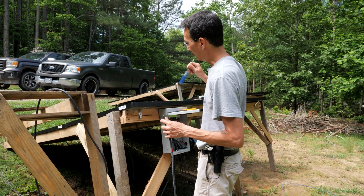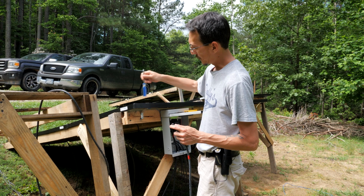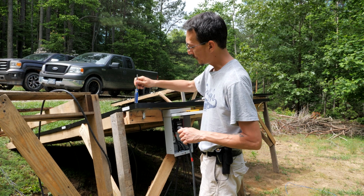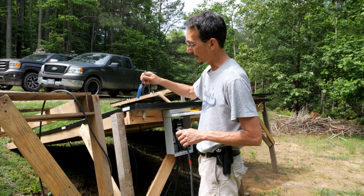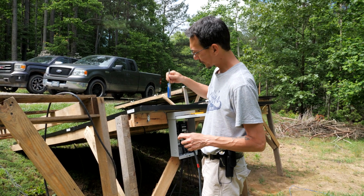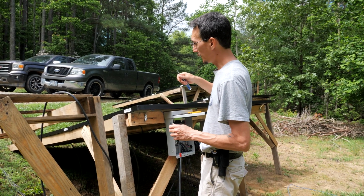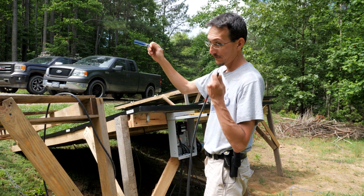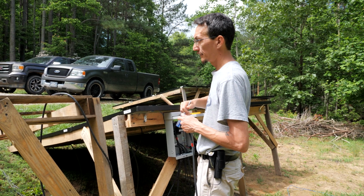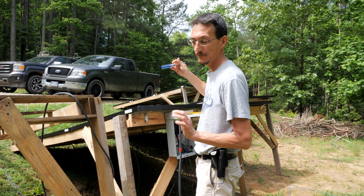So I'm planning to have these 3, each string of these 3 panels wired in series, and remember, when you wire in series, you're increasing voltage and the amps stay the same. Each panel puts out about 35 volts at around 8 amps in peak sun, and so wiring these together in series, we're going to be in the mid 90 volts at 8 amps. And so 90 volts pushing through this wire, we'll have about 3% voltage drop. 95 volts, I mean, we'll end up about 90 to 92 volts, and that should be fine.